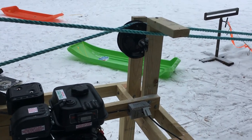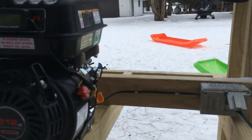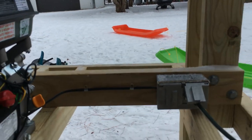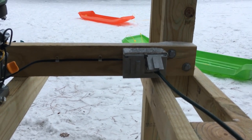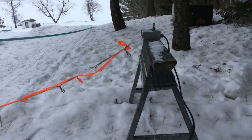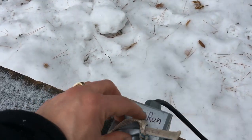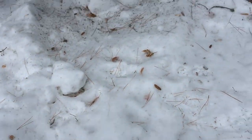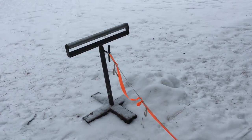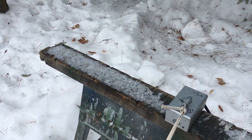For the kill switch, it's a very simple ground setup. The kill switch on the side of the motor — you turn it off and it just grounds it. I used household electrical components, so if I wanted to set it up farther away, I just use an extension cord. It's just a simple switch set to run or kill, and I've got a rope going across here. When you touch the rope, it's pretty sensitive — it just kills it.